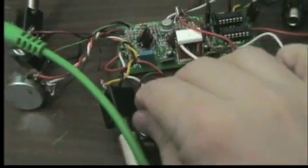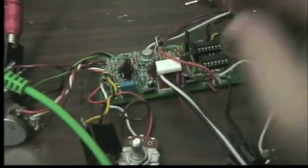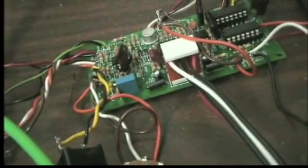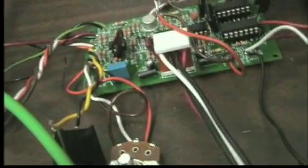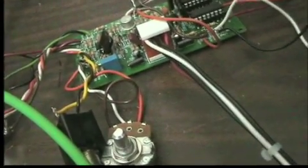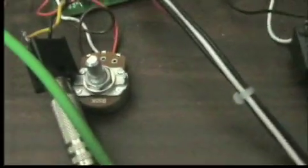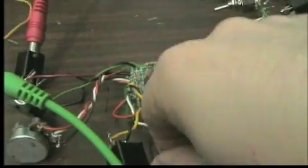This is just the raw pulser CV output. Notice it goes well up into the audio range. So let me unplug that. There's also a pulser pulse output, as opposed to the pulser continuous CV output. So let me plug into that — we should hear this kind of buzzy waveform. That buzzy wave you hear, that's the pulse output — it's like an impulse train. In another video I'm using this to control the envelope generator.